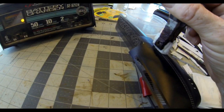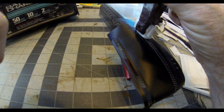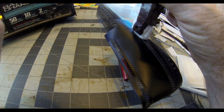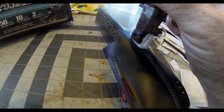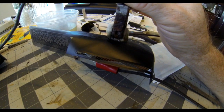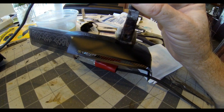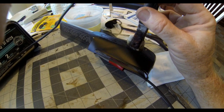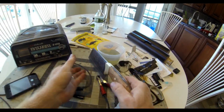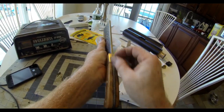Here's the blade back for the spine etching. I've got my self-adhesive vinyl cut out in the design of a rope, and I'm going to use the exact same process — moving the negative lead on the car battery charger from position to position, 15 seconds at a time, to achieve the same deep etching. This one goes much faster because it's a smaller area. I peel away all the vinyl and polish it up with that 500 grit emery paper.